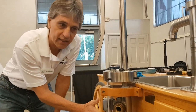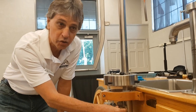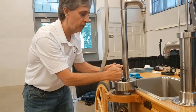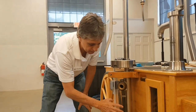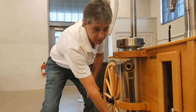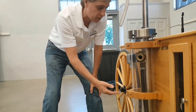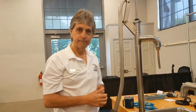What we're demonstrating here is that our pump coexists in a well casing with an electric pump. This simulates your pitless adapter, and these would be your wires for the electric coming out. Our pump is offset to the side so it can go down the opposite side. Unlike submersibles which are typically at the bottom of the well, ours only goes about 20 feet below static water level to allow for fluctuations in your water table, and then we start lifting water from there.